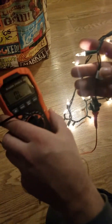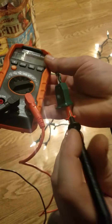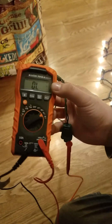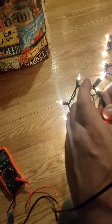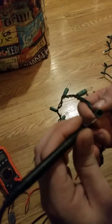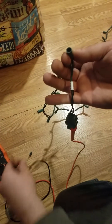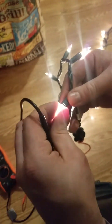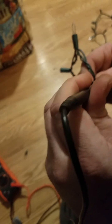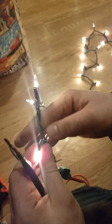I've got my electrical meter set to ohms with a continuity beep — whenever it touches contact with itself it'll always beep. I'm going to set that aside because all I'm looking for is a known beep. I'm simulating this because this light strand is working now, but if I get a beep that means the wire is good. Plug in a light — it's probably not going to light up — move on to the next bulb. Unplug it; as long as you have zero ohms or close to zero ohms it's going to beep. Plug in the next bulb.